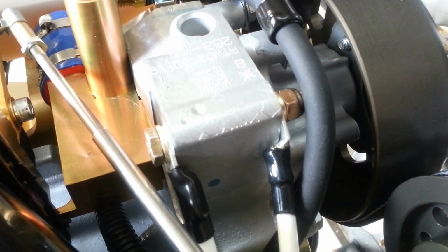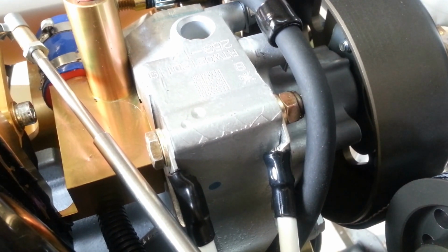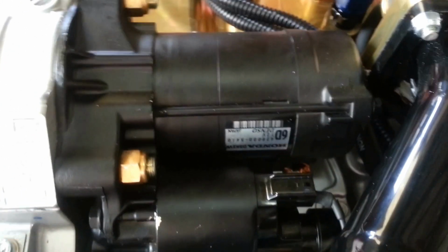That's the basic, or the most fundamental ground, or the heavy ground, in order to ground the engine using a number 6 cable. This number 6 cable is necessary only for the cranking of the engine. When the starter motor engages, you need a large grounding cable in order to support the large positive cable that runs to the starter. So that's the main reason for them.